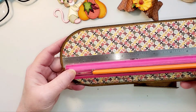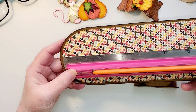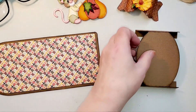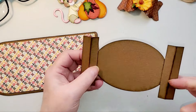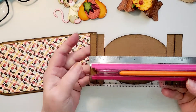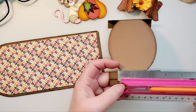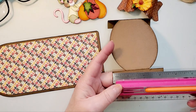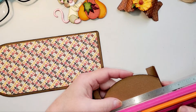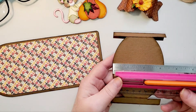My inside piece is about 8 and 5/8, maybe 8 and a half inches. I'm not very good at measuring, so that's approximate. This piece I just welded two pieces onto an oval. Overall it's 6 inches long. The two side pieces are 1 inch square — they are 3 and 1/4 inches long. The oval piece is 4 inches wide and 3 and 1/4 inches high.